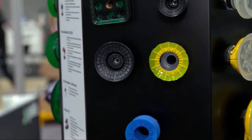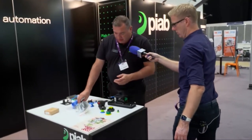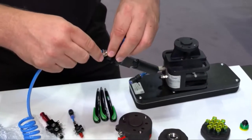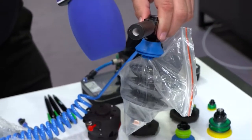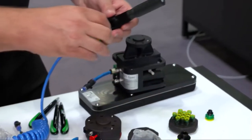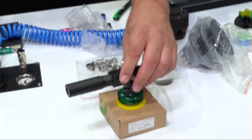The joy of your stand here is that we can also see these in application. We can take the same cups and screw them onto a little Venturi ejector, straight into the pod. We've got a lifter there that will do the lifting. And obviously we can change the cup dependent on the bag or product that we want to lift — so we just change it for a nice little cardboard cup. Nice and easy.